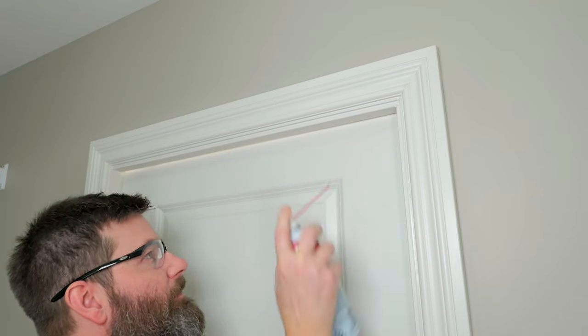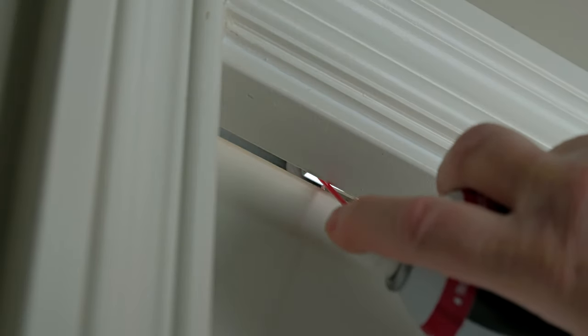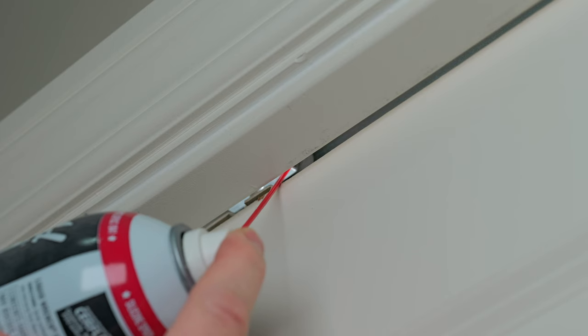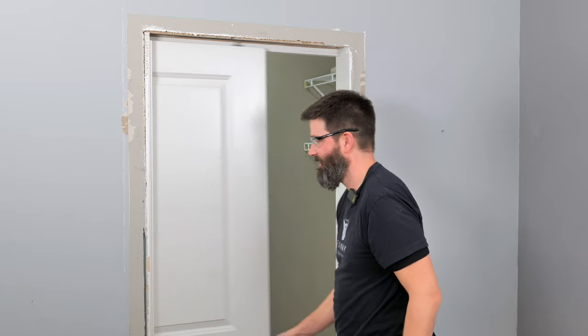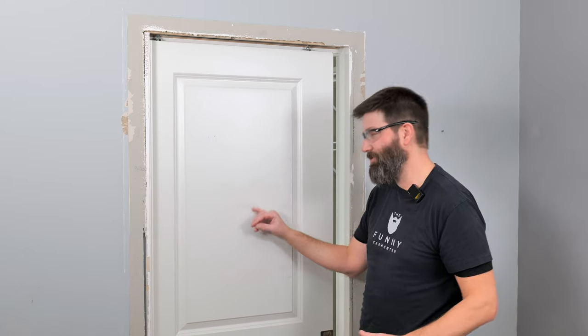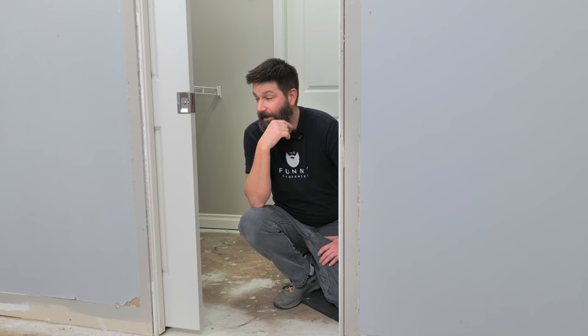Now this is what it's going to be like for you at home if you don't have things ripped apart. Shine your phone light up there, then aim the straw right into the wheel connection point and give it a squirt — that is a thing of beauty. If you need silicone spray, I'll link it in the description. If your pocket door has come off the tracks or is out of alignment, check out this other video where we dig deep into that.